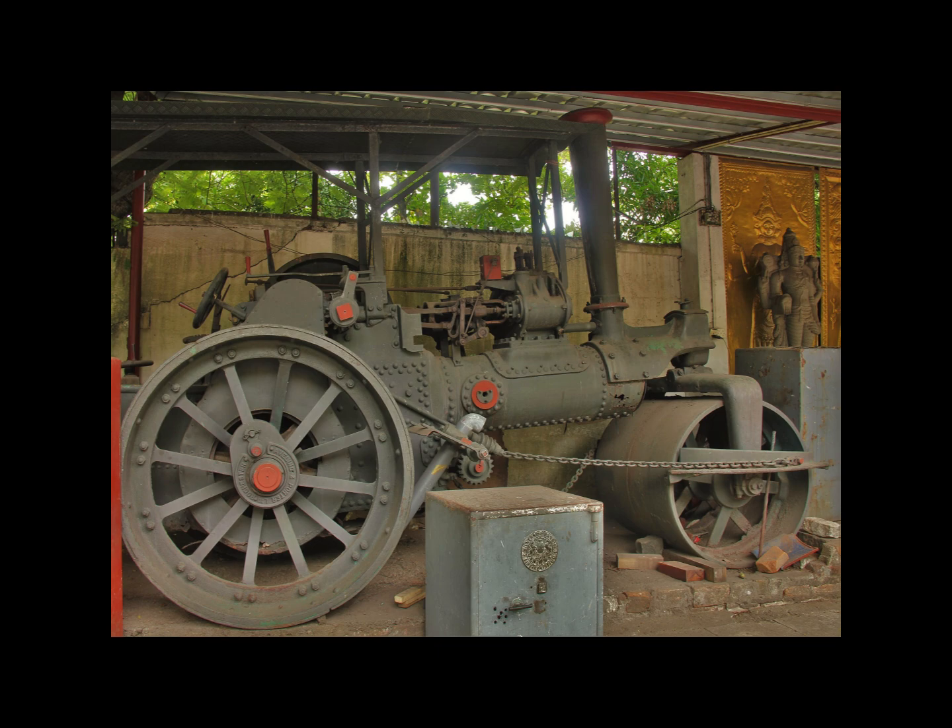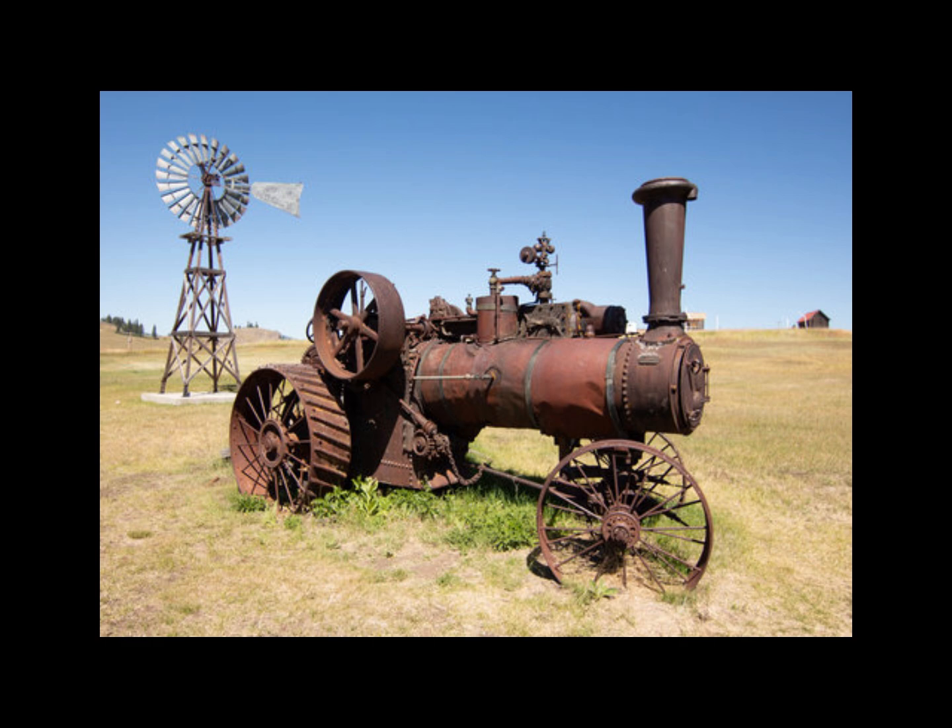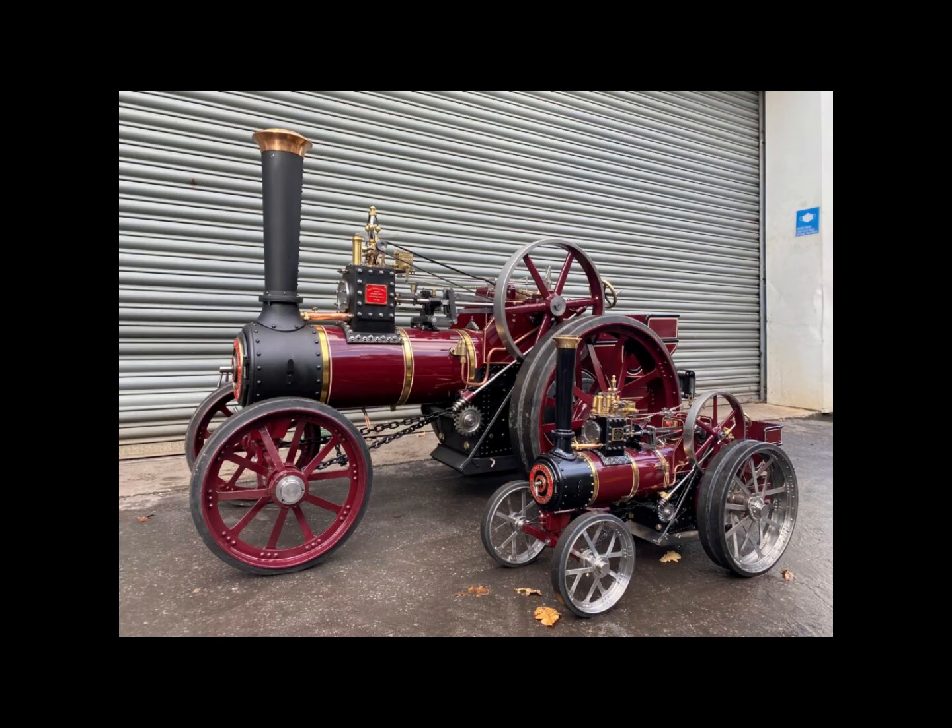With the development of a relatively lightweight traction engine specifically for road use, the Royal Engineers turned their attention to those. The first Steam Sapper was ordered from Aveling and Porter in 1868. Steam Sapper Number One was required to operate a 36-inch circular saw, grindstone, lathe, and joiner, as well as draw five tons up a one-in-twelve slope. It performed this, but was more than a quarter of a ton over the specified maximum weight of five tons.